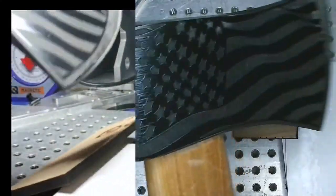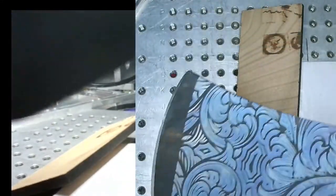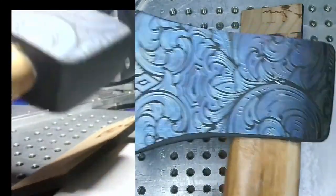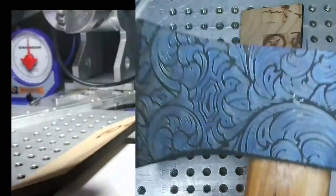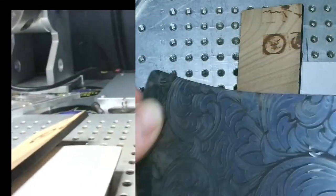Now, here's something interesting. I thought this blue would rust, but it was enough of an anneal to keep it rust resistant, and it's been like this for quite a while. And this is a non-MOPA that I found in the blue setting. It's really nice. There's kind of a little rust where the powder coat's there a little bit.